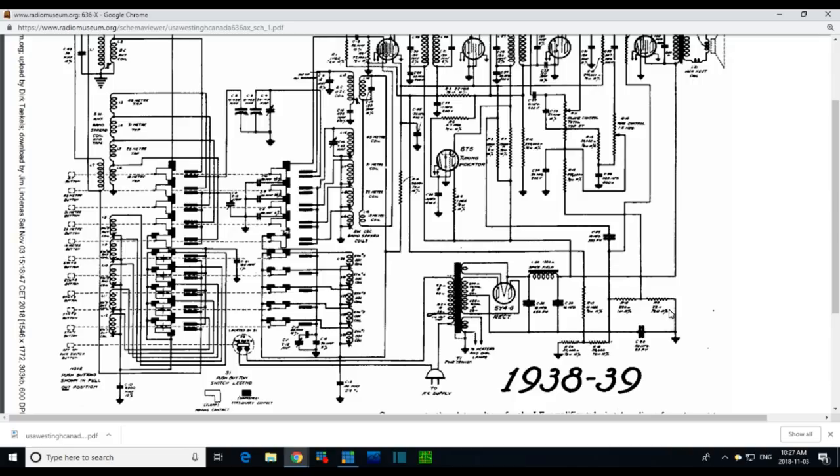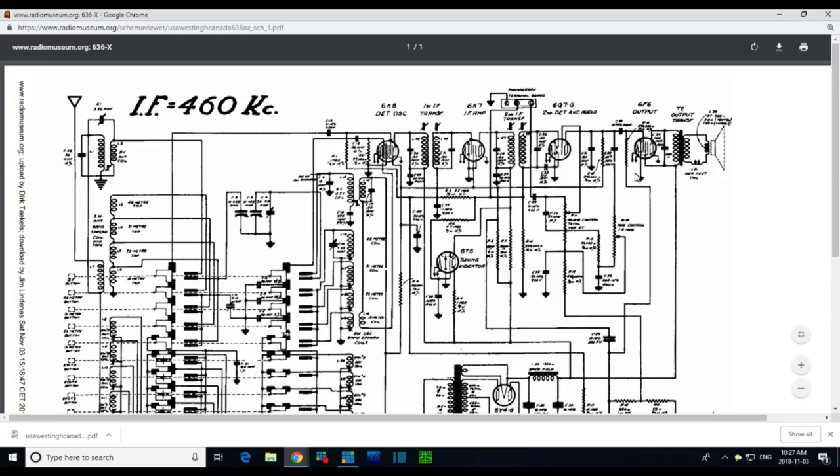That leaves these resistors. I can say a little more: these resistors will leave the chassis positive to the negative bus. That makes anything tied to the chassis positive to the negative bus. Okay, I'm going to explain this a little better. Here's the negative bus through this big resistor, and here's the chassis positive to the negative bus. So that means, you turn that around, negative to the chassis. And that would be the bias. And we saw in the book, the bias for the 6F6 should be around 15 volts negative, and my measurement here was 2.